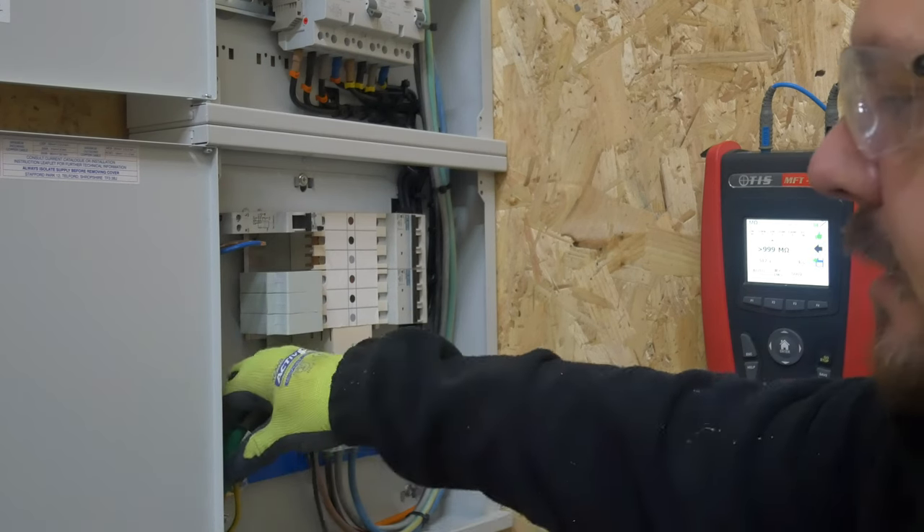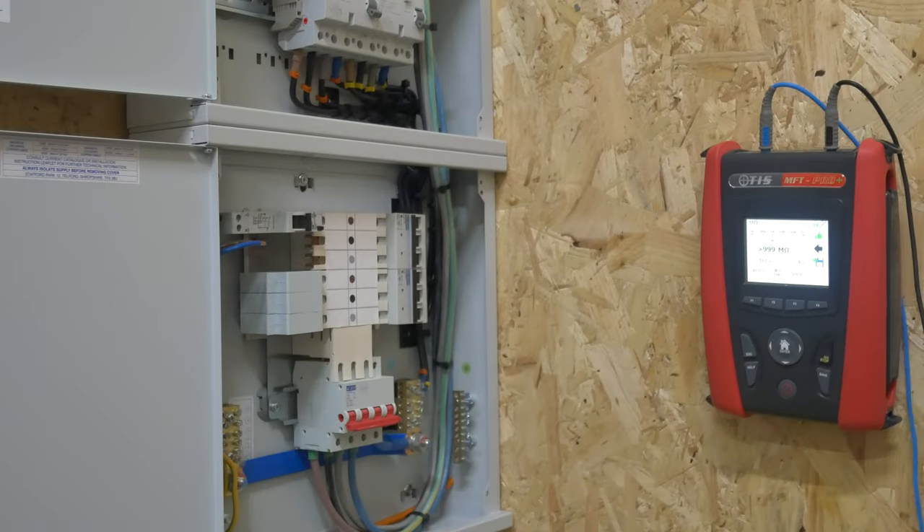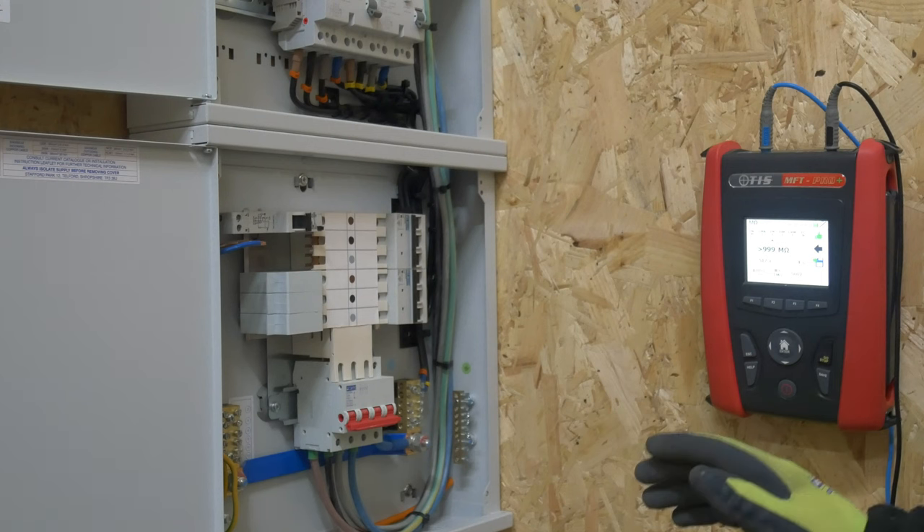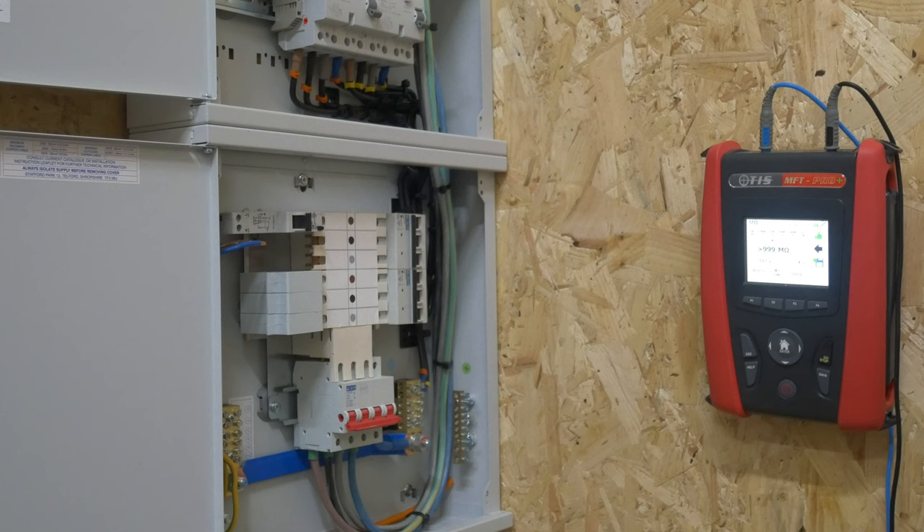So we've done that five-step process. We didn't shortcut it and go for four because I couldn't find a skilled inspector who's competent and knows what he's doing — so we've done it the basic way and that's all clear. We now know we've got our continuity of conductors and the cable down to this end where there is insulation resistance between all live conductors, neutrals and the CPC. We know we're in a safe position to energize this circuit. We'll now have a look at some live testing, which will involve some extra elements of PPE.